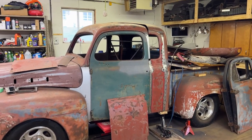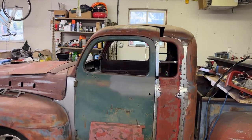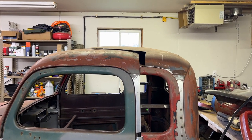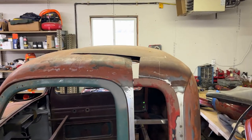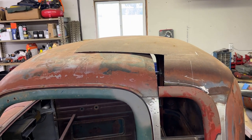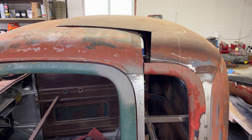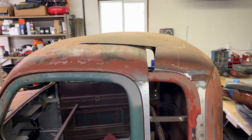I'm working on trying to make that roof — as you can see it's a big split — trying to fill that in and make one solid roof out of this vehicle. Where the extended cab is, you can see it sticks up a little higher and it's almost buckling, so I'm gonna cut all the way back there. I did some marking on it; I'm basically gonna cut the middle of the roof panel out on both the main cab and the extended cab — just cut all that out because it's binding and causing the roof to bend in different ways.